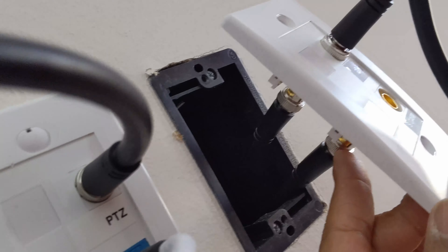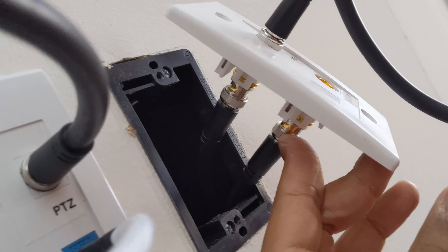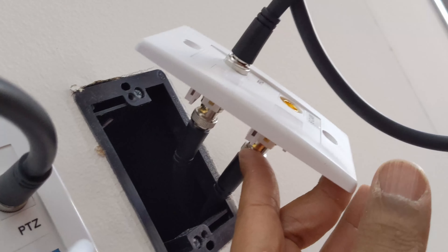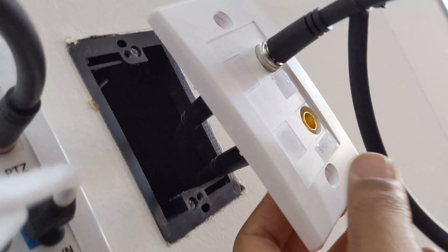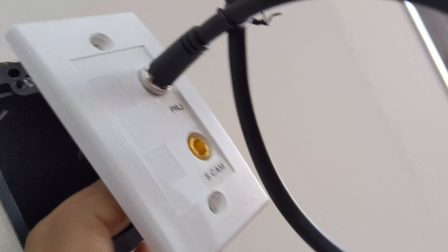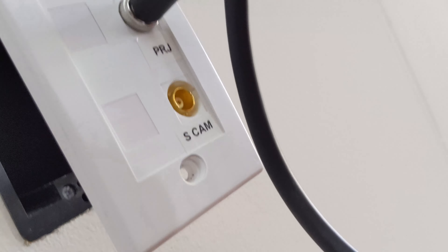As you can see, here's the SDI cable that's routed back to the static camera. So we're going to hook up the HDMI to SDI converter back behind here, set it on one of the secure blocks back here so that it doesn't fall, run some power, and then change out this keystone — the label is still going to be the same. We have it here just in case we ever decide to add another camera.